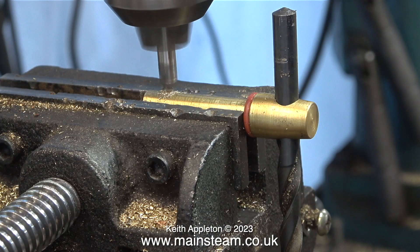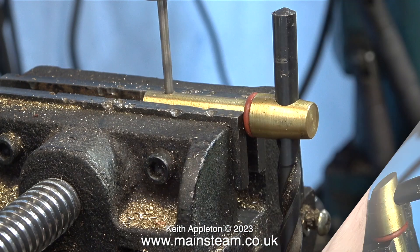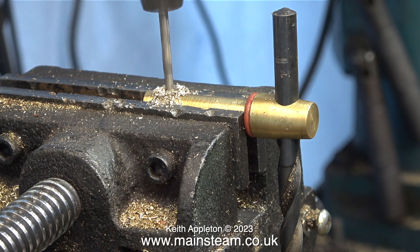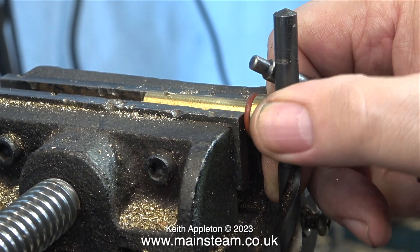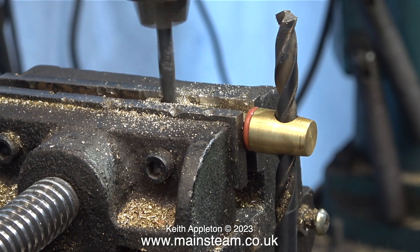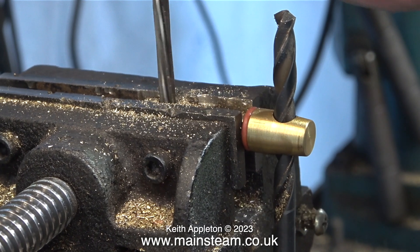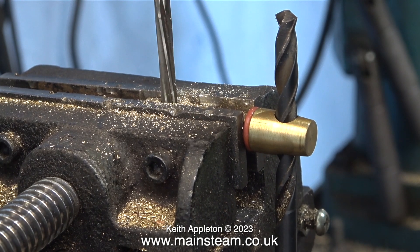I know that the drill shank is vertical and as I start the drilling operation I keep my eye on it to make sure it doesn't move — in fact I've got my thumb on it at the moment. I didn't rest the part on anything and really I should have done. Instead I'm just drilling the hole gently so the part doesn't move in the machine vise, and I didn't go through with the finished size drill. This is about halfway through the job and it's a 3/16ths of an inch diameter drill. At this stage I removed the part to check the other side — the hole was in the centre. I carefully refitted the shaft, went all the way through with a drill one imperial size less than a quarter of an inch, then finished the job by hand using a quarter-inch diameter reamer.